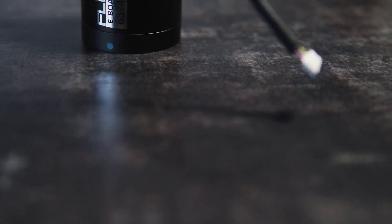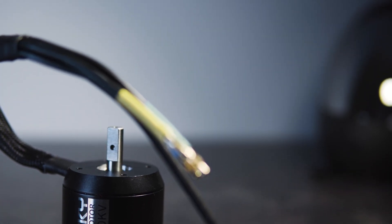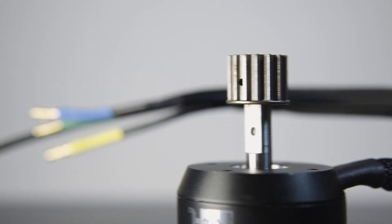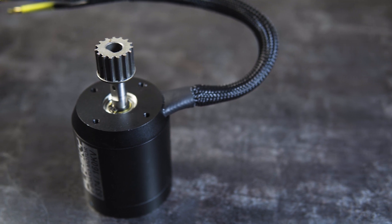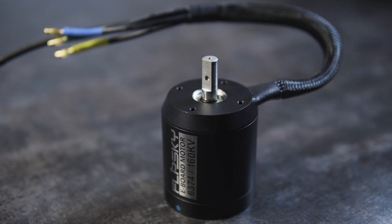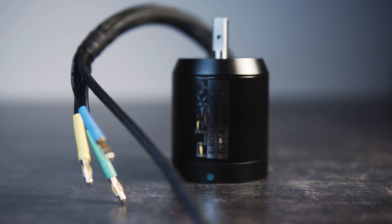The length of the shaft is around 32 mm and the diameter is 10 mm. If you are thinking about ordering motors, don't forget about motor pulleys. You need to choose the right shaft type first. In our case we have D-shaft steel motor pulleys with 15 teeth. These pulleys are indestructible — I've been using them for one and a half years on my electric skateboard and they still look brand new. They fit perfectly to the motor shaft; you only need to tighten the clamping screw.